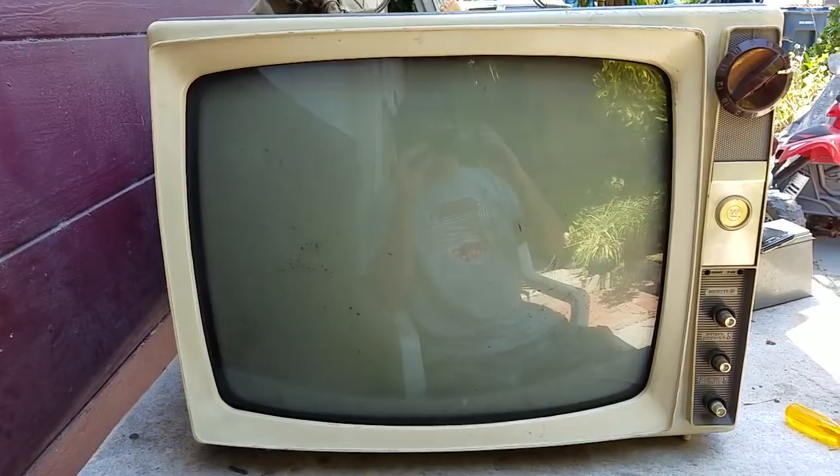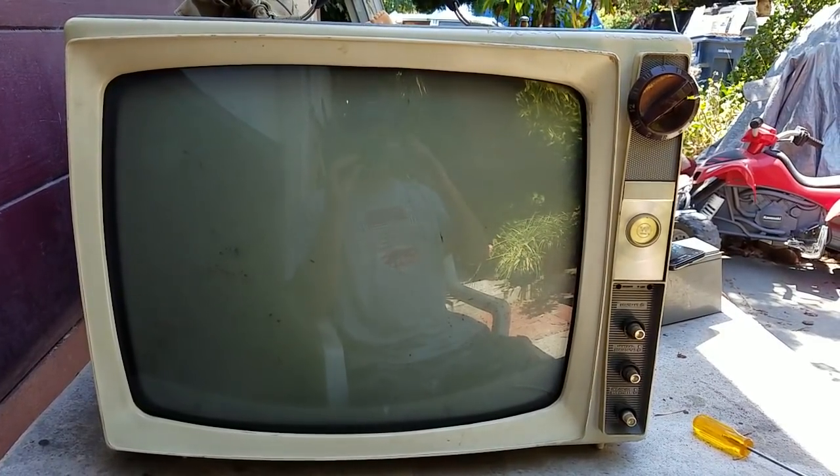What we're going to do is check the B+. This uses a capacitor doubler circuit for the line voltage. I don't want to spend much time or effort on this because the CRT is weak. I have a million of these black and whites and kind of nobody wants them — it can just go in the trash if I can't get it to work fairly easily. So we'll pop the back off, pop the resistor in, do a couple voltage checks, and see how it looks.